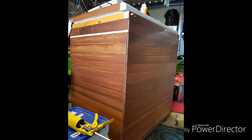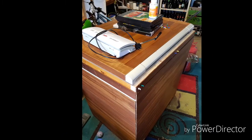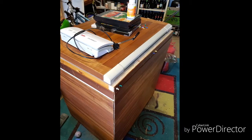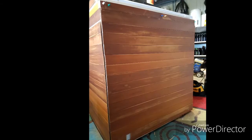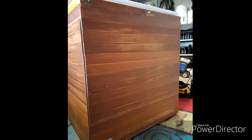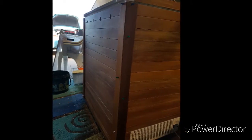I had to end up drilling from the back of the collar and just to the point where you could see the end of the spade bit coming through, and then I drilled through from the front. As you can see in that photo there, that's one of the side slats put on to get a general idea, and then you can see slightly the top exposure of the collar there. So as you can see, the varying colours of the slats where they've been sanded back. I think we used a 600 grit paper on that to just create some high and low colour points.